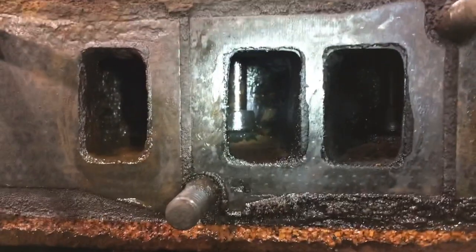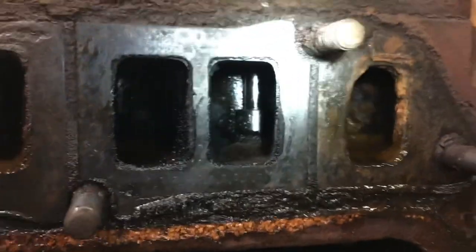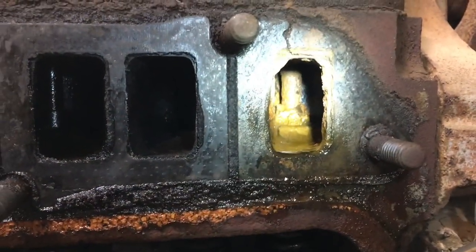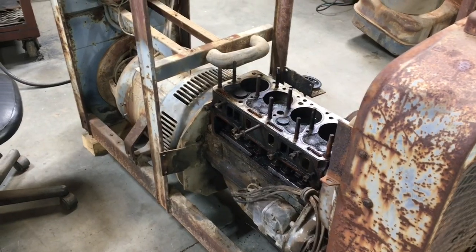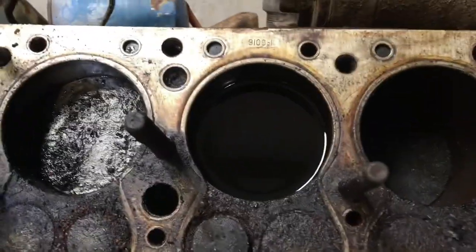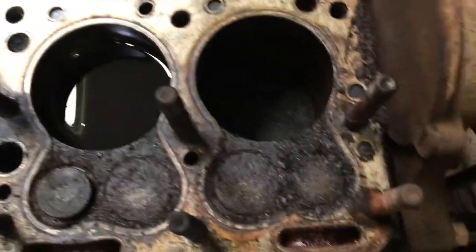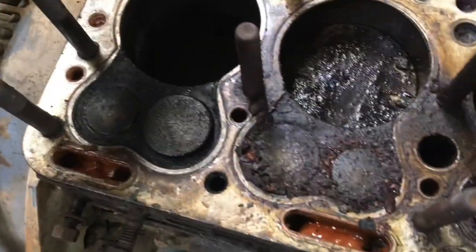Intake — let's see, that's what it should look like. That one's pretty good. Not good. Yeah, this is bad. All right, so the cylinder head is off. That one's holding liquid, so those piston rings are stuck. These three are not — still don't look good.